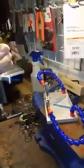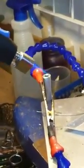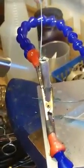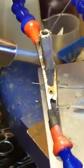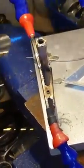I'm using the solder that we carry, rosin core, lead-free solder, and I'm going to warm it up with a little butane torch. We're just going to use the solder wire and feed it in right around the edges. I'm keeping my heat close by, so you can go around and feed it in right between the nut and the handle. Oh, I got a little on the side there. Got a little extra solder there that I don't really want.